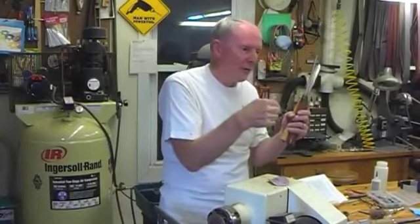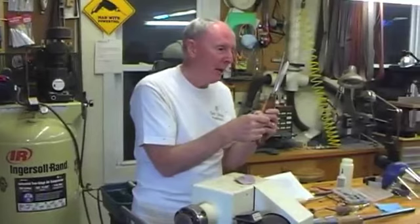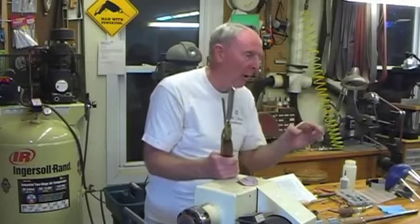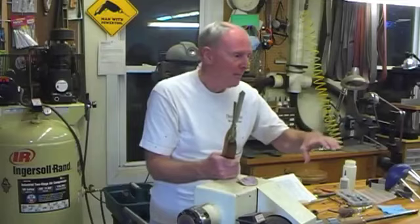As soon as you're down in there, then you make the cavity a little bit bigger, leaving more mass in there, and then you can shape the outside a little bit more, go down a little bit more. Leave the mass there, going to the chuck or the faceplate, to support the hollow. Once you get down to the end,